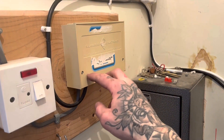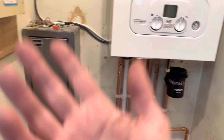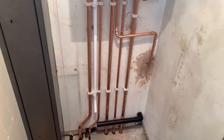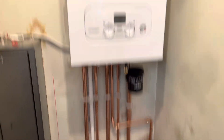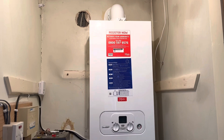This is basically just a big junction box — the live goes into it into a chock block, then straight out. So there's no real need for it, but it's there. Hot and cold are obviously on. Condensate to finish, blow off outside. That pipe looks pissed but it's not. Gas is tested and live. We're winning.